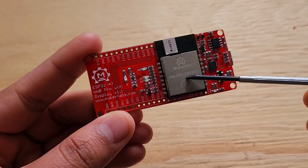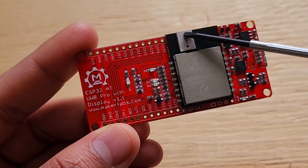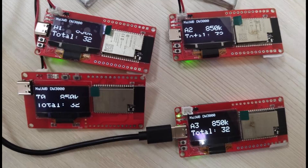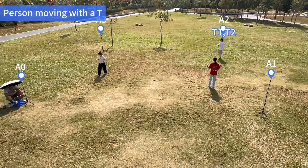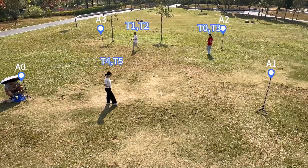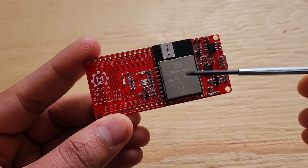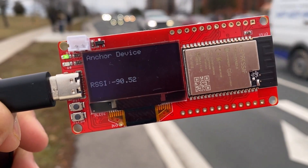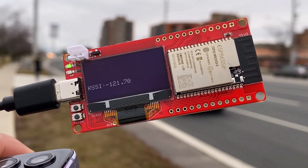On the back side, you can see a dedicated customized UWB module from MakerFabs. The best part about this board is that it fixes issues between many anchors and tags. It can handle up to 8 anchors and 32 tags for creating a system that tracks multiple positions. This product is great for high-accuracy ranging and localization, with a ranging capability featuring PA plus LNA which can expand the signal range up to 500 meters.